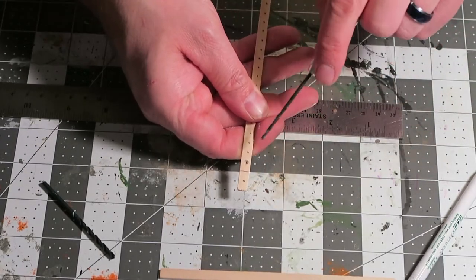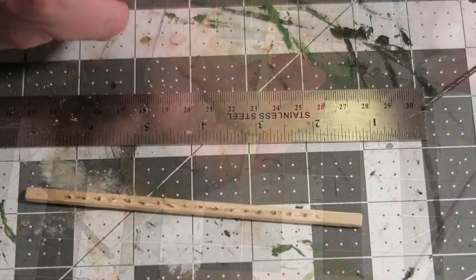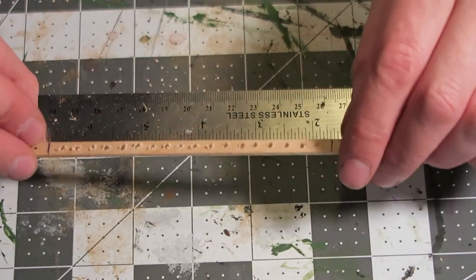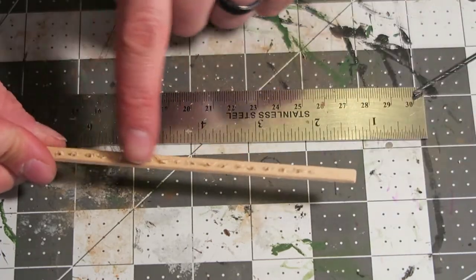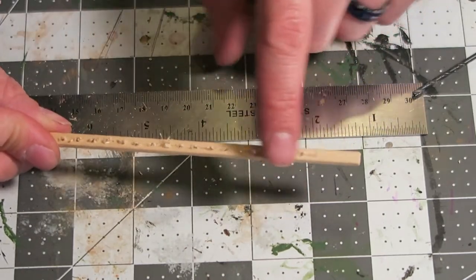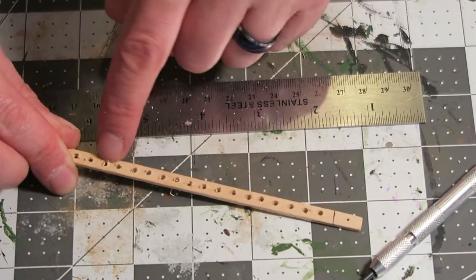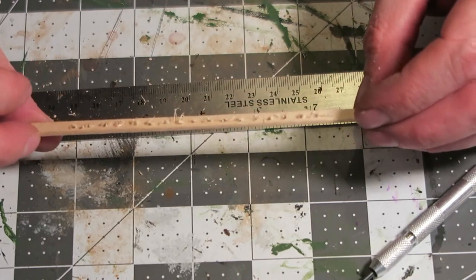I'll come back after I finish drilling all these. Now I've zoomed in a bit more so you can see — I have my 18 holes; they're probably not all 100% centered but that's what makes it a little more unique. Just to let you know, you will get a whole bunch of splinters coming off here. So just take some 220 grit sandpaper and sand this down. While drilling, even with the hand drill, you may hear the wood kind of pop and snap and it might put a little line in it — but don't be too worried about that.